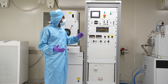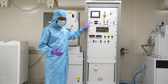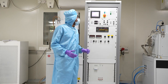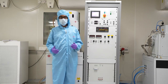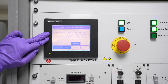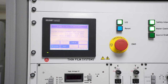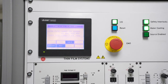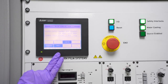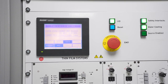If we vent it, then only the chamber will be vented, but other lines to the pump will remain on. We want to keep the pumps on because immediately after taking the sample out, we will go for another vacuum cycle. We will press vent here. Chamber vent sequence is going on now and the air admit valve opens. The status says 'chamber vent sequence is going on' and the air admit valve — the vent valve — which we showed you earlier while introducing the tool — is now open.